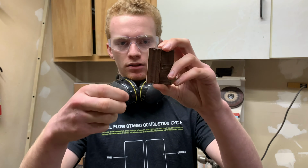So what I got right here, I completely forgot what this tool's called. Basically this piece goes in the middle, it clears out any glue that may have gotten inside the tube, and then this part will bring the height of the wood down to the same height as the brass. So just plunge this in until I see a tiny bit of brass shavings. It's pretty simple. Focus, there you go. No idea what this thing's called. I completely forgot. A lot farther down than usual on this piece, but as you can see now, the wood and the brass are flush. And then all this part right here will just get turned off once I put it on the lathe. So now I just got to do it to all four sides.